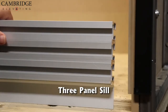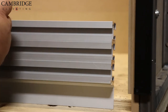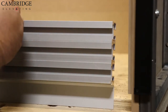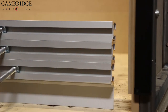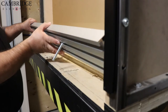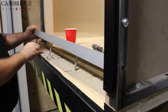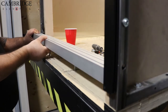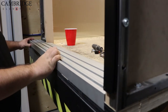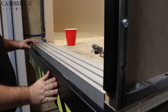Take your three long carriage bolts and slide them into the bottom of the sill — these come in your hardware packages A and B. You'll see there are holes notched in the floor for our sill. Take the sill and line up the carriage bolts so they all line up with the holes. Drop it into place, push tight to the right wall or left wall, and line up the flat edge with the face of the floor.